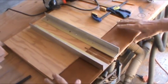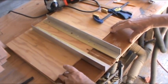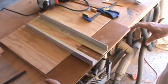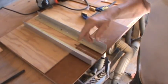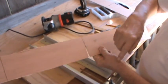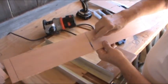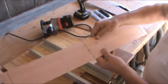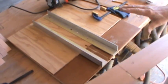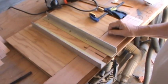This space I left here is actually a little wider than my widest rib — my widest rib is 4 inches and this is about 5 inches. The reason for that is when you're doing a spar, it has a curve to it for the rocker, so you have to move it a little bit. Mark the spar the same way — mark it all the way through, mark how deep you want to cut it, and remember: on the ribs you're cutting from the bottom, on the spar you're cutting from the top. You'll have to put it at an angle in some places, so you need that extra room. Just do them carefully, one at a time, clamp them nice and tight, and you'll have a perfect fit.